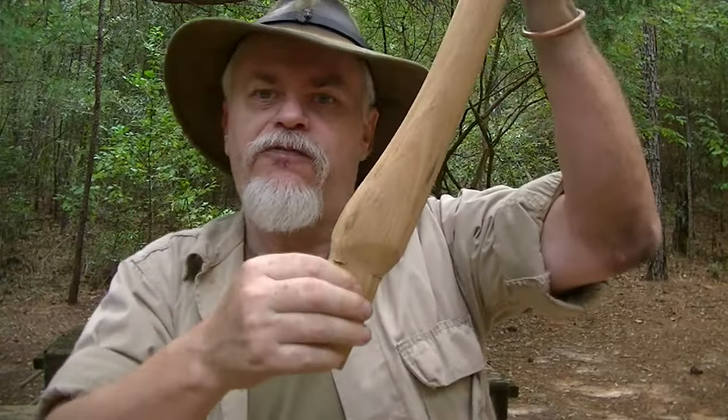The proper way is to fit the eye into it and then hit it on the bottom and let the axe head walk its way up. The shockwave of hitting the wood acts like a bristle brush — it jumps the wood forward and allows those grains to flex and pop forward. I'm swaging this wood into that eye rather than beating it into the eye. If I beat it in, it's cutting it. If I swage it in by smacking on this end, it fits in and the grain of the wood is more relaxed. When I get it bottomed out and give it those last walks on the butt end, those shockwaves cause any grain that's hung up to flex and settle — like putting on a jacket and working your shoulders around. This makes a very smooth, even grain fill.